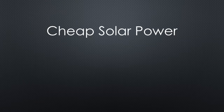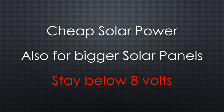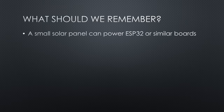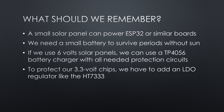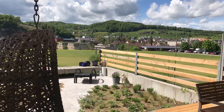We now have simple and cheap solar power for all our small devices. It even works without deep sleep if you increase the solar panel size and adjust the charging current accordingly — just make sure you stay below 8 volts, otherwise you fry the TP4056. To summarize: a small solar panel can easily power our ESP or similar boards; we only need a small battery to survive periods without sun. If we use 6-volt solar panels, we can use a simple and cheap TP4056 battery charger which includes all needed protection circuits. To protect our 3.3-volt chips, we usually have to add an LDO regulator like the HT7333. Adding a power path makes our solution nearly professional — unfortunately, the way I built it was less professional but highly efficient. Now summer can come!